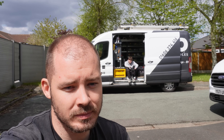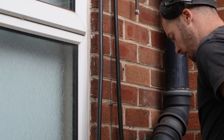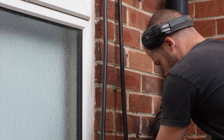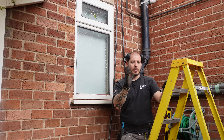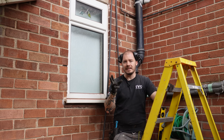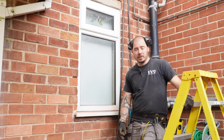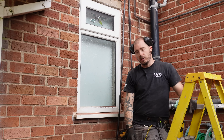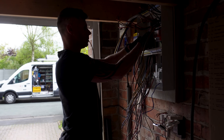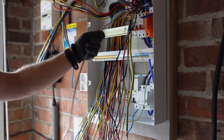We're using the Doncaster PV Ultra cable again on this job. We have four strings — four sets of seven panels — and we're using the four-core version, meaning we only need to run two sets of cables all the way to the top. It's a little tricky up at the gable end with the chimney — the space where we can enter the loft is quite small. We've got gas pipes on the outside, soil stacks, windows — a lot to contend with, so we need to be flexible. Five o'clock on day two and we've got quite a lot done: Matt's finished the board, all the front array is on, the back has just been finished off. DC was a bit of a nightmare to get down and the board's been tight — one of those slow days, but the hard work is done.